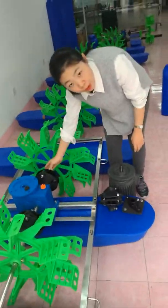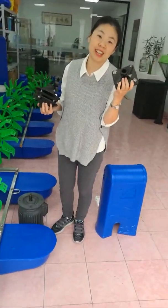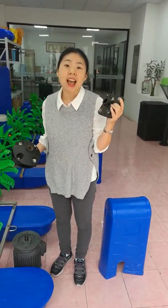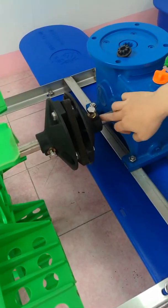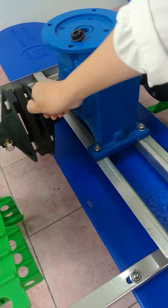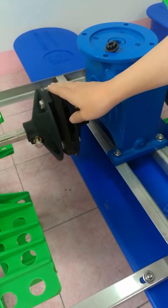The next is the connector. This is our new buffer connector, and this one is the old buffer connector. The old structure is rubber with iron. Since our aerators are used in water most of the time, the iron installed on the bearing — this part — is easily corroded. If that happens, it's terrible and very hard to replace the parts.